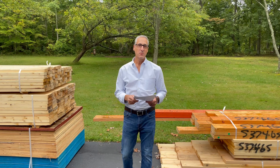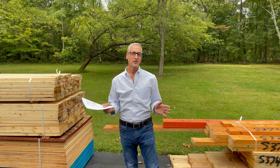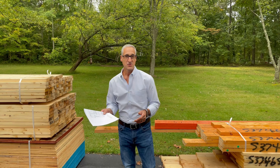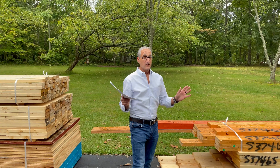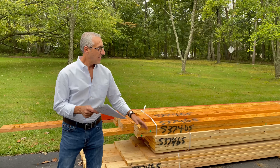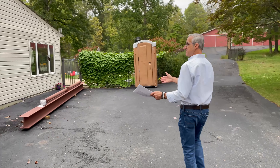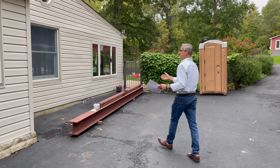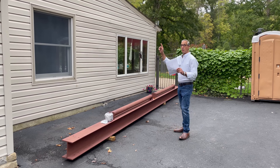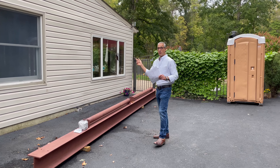Hey, Story from Interior Trend, and we're back at the Green Lane project. Today we finished up demolition, which was phase one. If you guys want to see more detailed pictures and videos of that, follow the link below. Now we're on to phase two — framing. You can see this massive pile of LVLs, studs, beams, plywood, and this massive 25-foot steel beam. This steel beam is going to go through this window and hold up the existing house from the addition in the back.